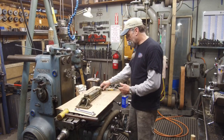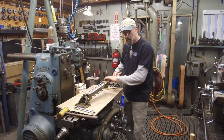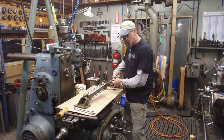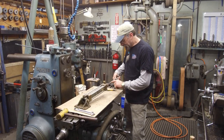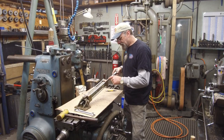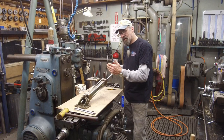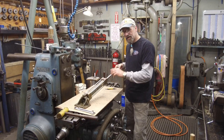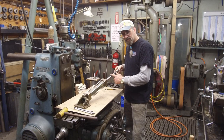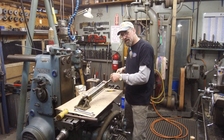What happened was a grab with one of those tools on here, and then trying to break loose the old rod in, and it created a dig in here. And then this went and traveled its stroke. The outside is a wiper. The wiper is basically to wipe and keep everything clean off of this nice polished surface. If it's heavy equipment, it'd be chrome. And this is a marine cylinder. This is a piece of stainless steel, so polished stainless steel.